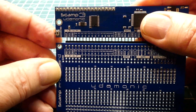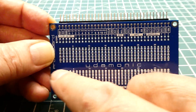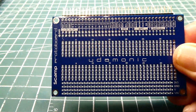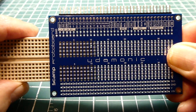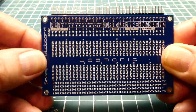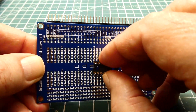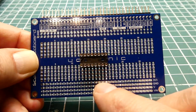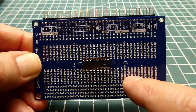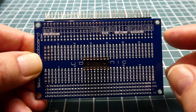As we're doing our wiring we don't actually need the SCAMP3 board plugged in — we can disconnect it. In the middle is our working area, similar to a solderless breadboard, with an isolation channel in the middle where we can straddle an IC across it — just plug in our IC. Then we can wire it into our working area and grab any one of the pins from the pads on the SCAMP3 bus.